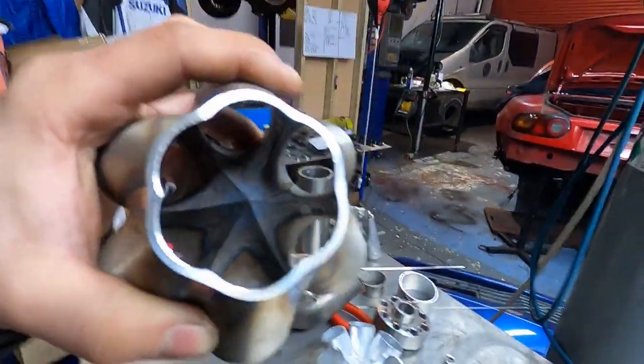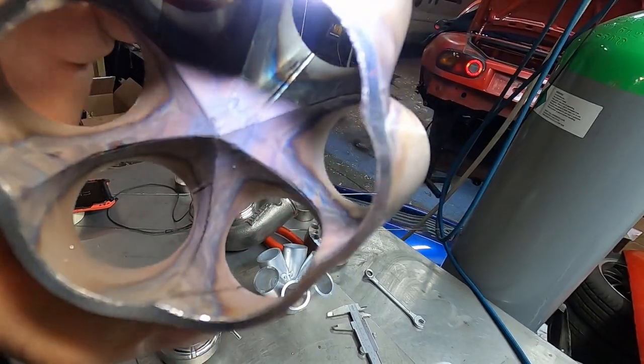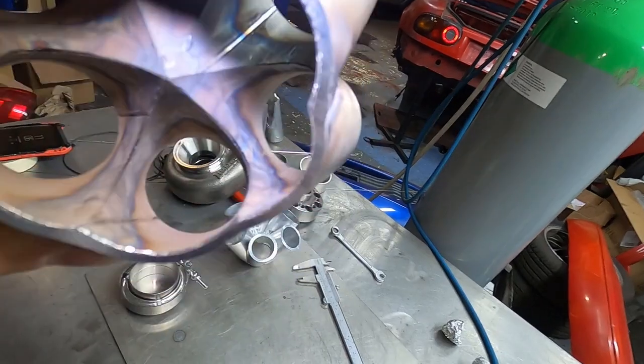You can see something inside there — small spots. Let me put the light on. You see? Those small spots — that is actually penetration going through. I don't usually go completely through because it pulls a little bit more, but you can see some spots go through. I call it about 85-90% penetration. That's good enough because it helps stop the material moving too much and prevents the pull welds from over-pulling. Everything stays in place.